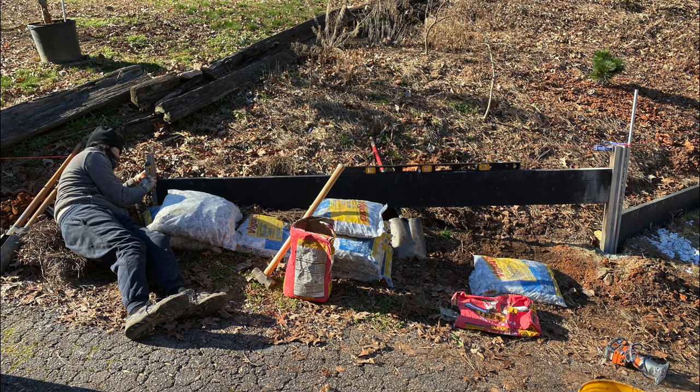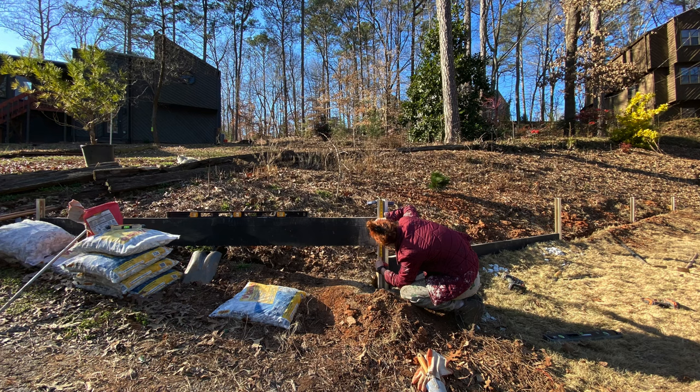The goal we're reaching is that we will be three boards tall. And that's tall. On the high side, what's happening is where Spencer is, it's bottoming out into the ground over there, but on the right side facing the street some of the boards will be buried by a couple of inches into the ground, and on the driveway side one of the boards is going to be buried a whole lot. I put a screw through the back of the aluminum — I used a drill with a metal drill bit through the metal and then put construction screws through it, and that was holding the board exactly where I needed it.